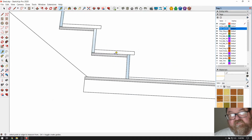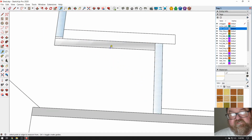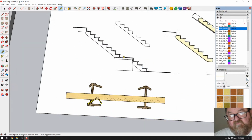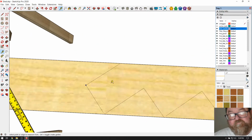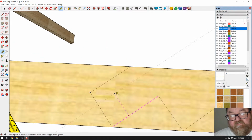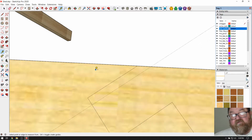All right, so let's measure that again. You're going to measure this stuff 3 times before you cut it. 6 3/16, okay? Now, this is real life. We're going back over to our board. We're going to measure down from here, and I know this is upside down, but you can do it. 6 3/16. You can think upside down, okay?